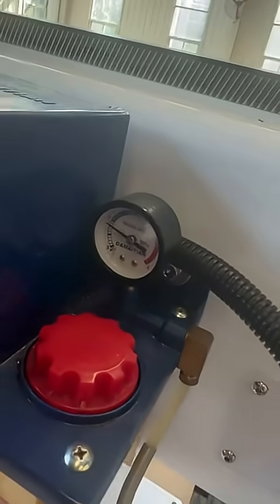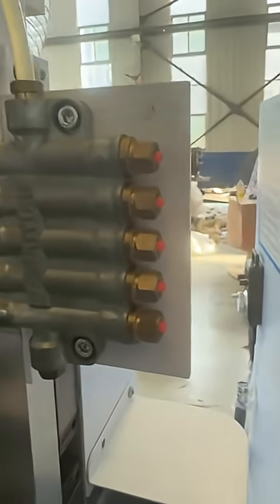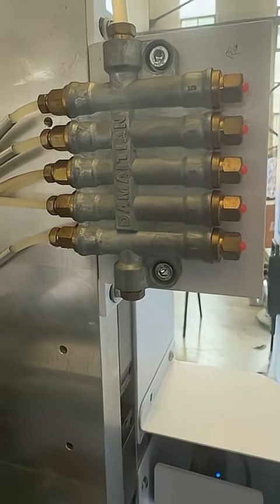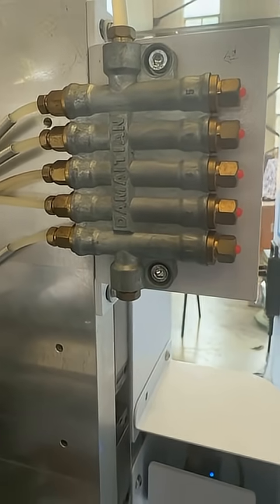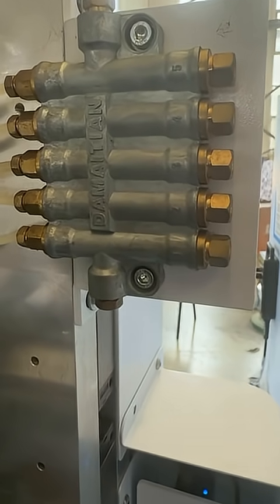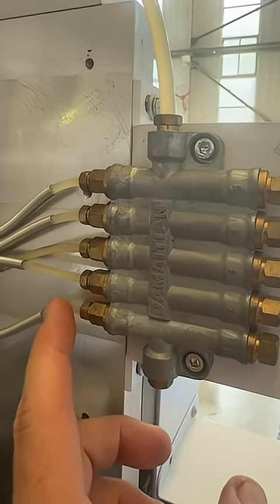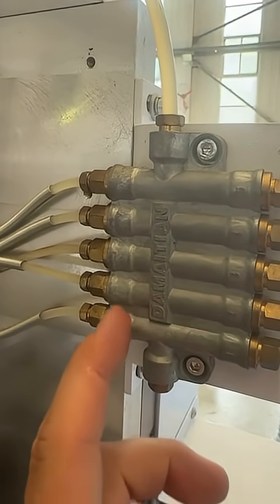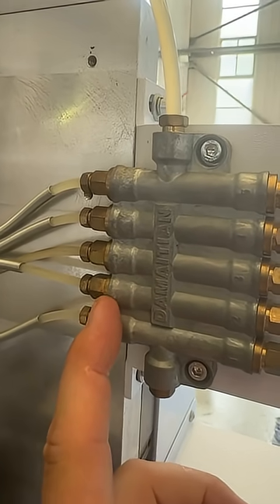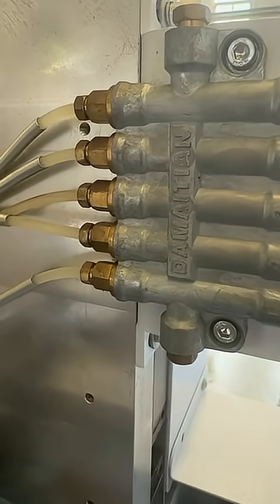The pump's filling up now, so we should have all five of our plungers out — they're oiling the blocks right now. As soon as our 16 seconds is over, you'll see your markers go away and they've injected that oil. There's also a plunger in here with a stopper that is preventing it from continuously running and keeping backflow from coming back into it.